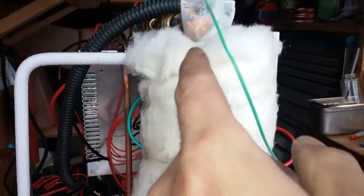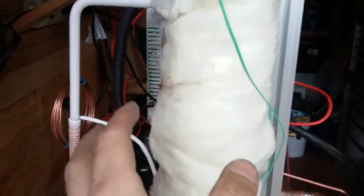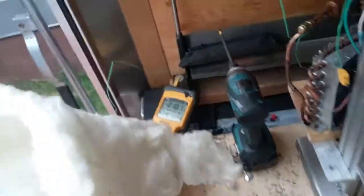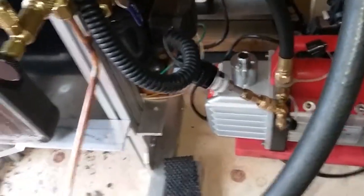What ought to be happening is it's actually drawing — this is the line right here — that the vacuum line runs back through, runs through the dryer. The one-inch pipe is filled full of copper scrubbers. You can buy them at the dollar store just to get a little more surface area, make sure those vapor molecules have to pass through all that. That should be good and frigid. The dryer runs at about negative 40 Celsius — about negative 38 right now. So, it should pretty much condense anything being passed through the dryer and avoid the vacuum pump having to pump it. It keeps the vapor pressure low in that portion of the system.